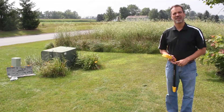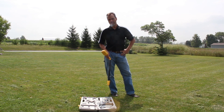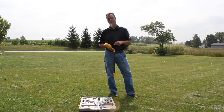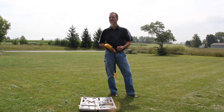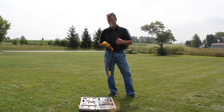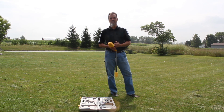This portion talks about irrigation systems. Irrigation systems, unlike cable TV, electrical lines, or phone lines, are a little bit different. Because you have a solenoid on the system, and at the frequency this uses for induction — which is 175 kilohertz — the solenoid acts like a big resistor. As a resistor, it knocks the signal down. So this mode doesn't work as well as it does on cable TV or electrical, but it is still useful in irrigation.